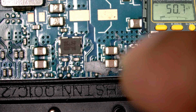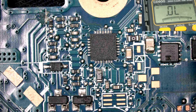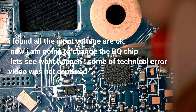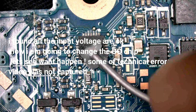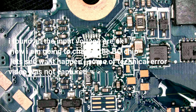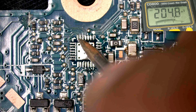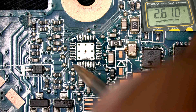There is something — 8.0 volts, 5.0 volts. Here is 18.82 volts present. This is the 6th pin — this one is AC detect. And here the voltage is 2.6 volts, which is okay.